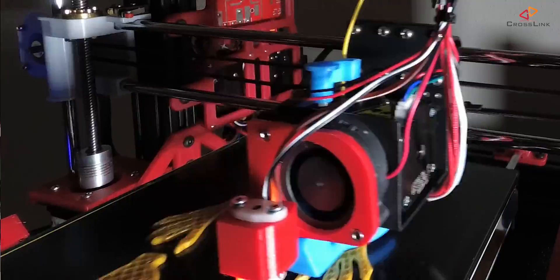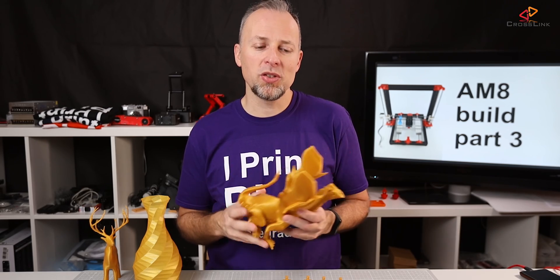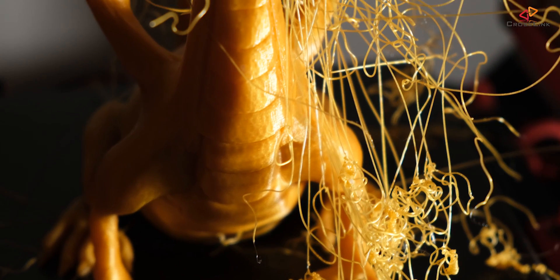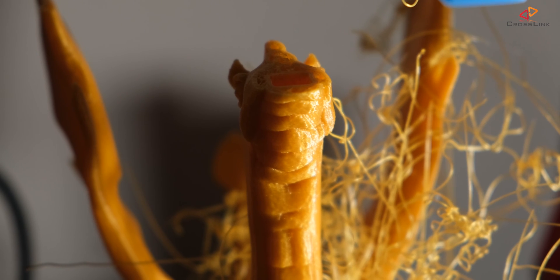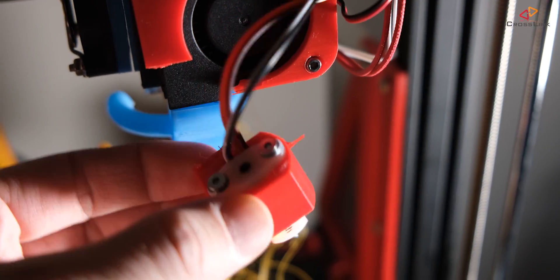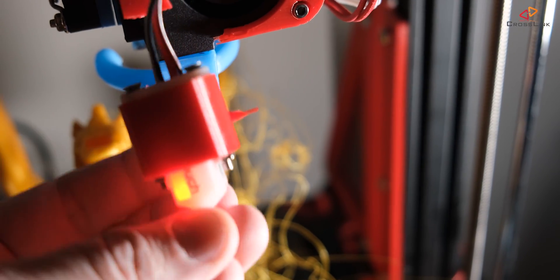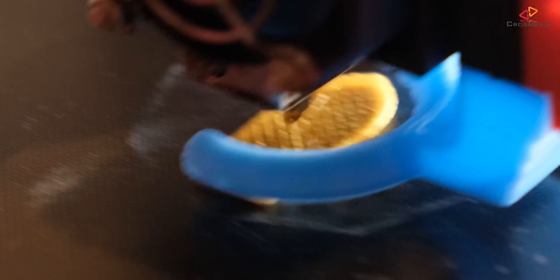After the maximum speed test, I switched back to the default settings at a lower speed for a third larger print. It started pretty well, but in the last one or two centimeters the print started detaching, creating a lot of stringing and the print was pretty much messed up. What actually happened early during the print is that my 3D touch holder broke — that wasn't really causing the stringing issues, but it showed me that during the maximum speed test, the printer was pushed really hard. The high jerk values caused a lot of vibrations in the whole printer frame.